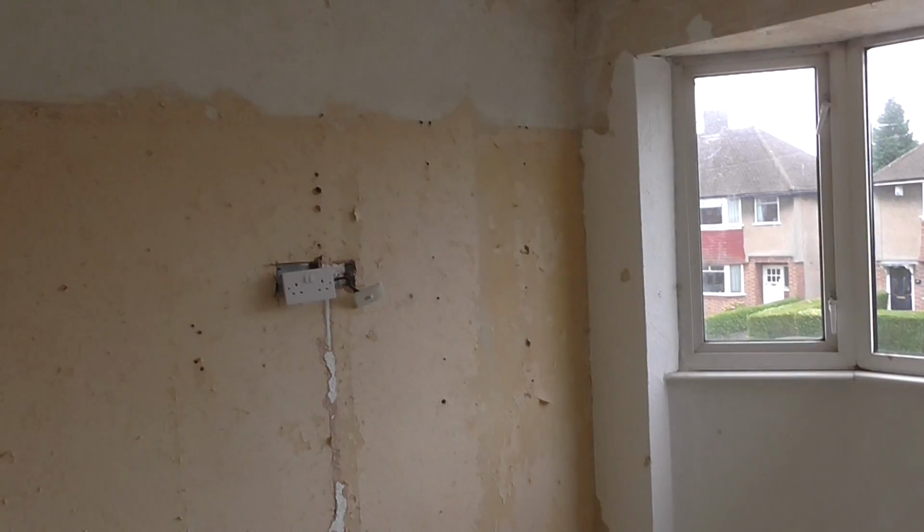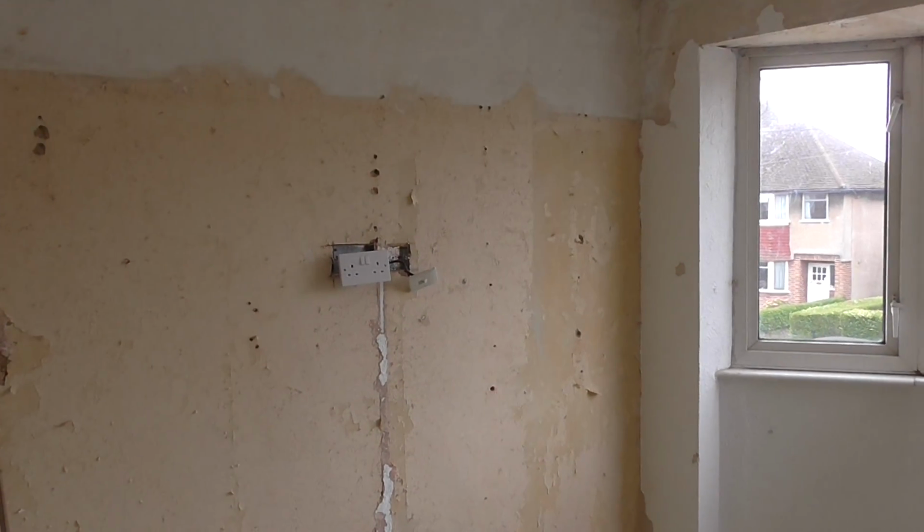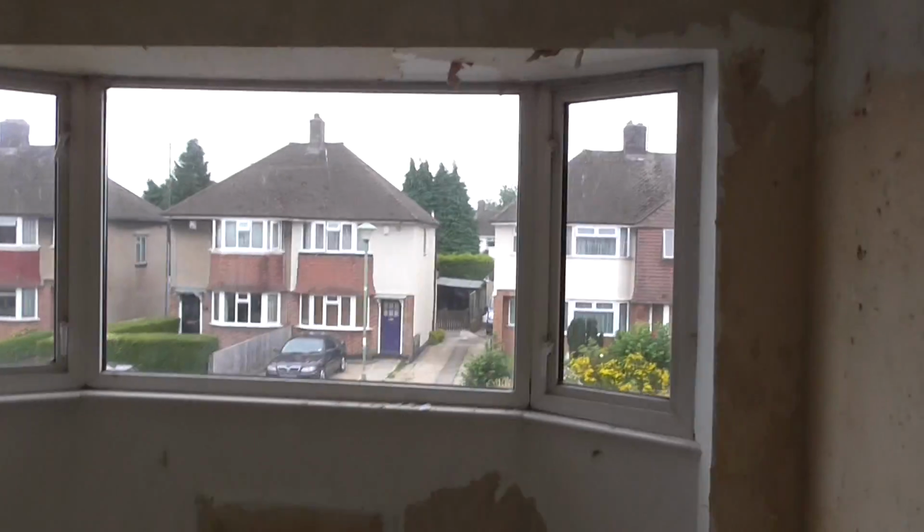So what we're going to do, once we've stripped everything, these walls are alright because it's not textured paint onto paper, that's just straight onto the plaster. What we're going to do is put the Plasprime primer adhesive, and then, especially on walls like this, a coat of Thistle bonding coat, because this is quite pronounced. It's about 3 to 5 mil thick, it comes out, and then we're going to skim it over with some bonding, key it up with a nailed float, and then re-skim everything.